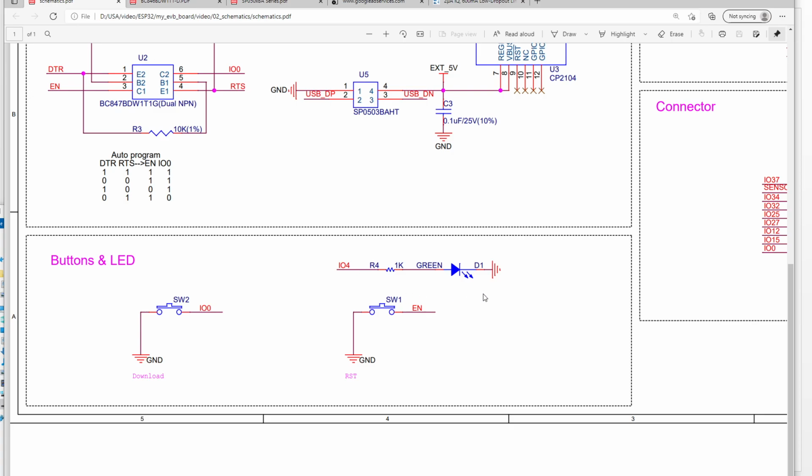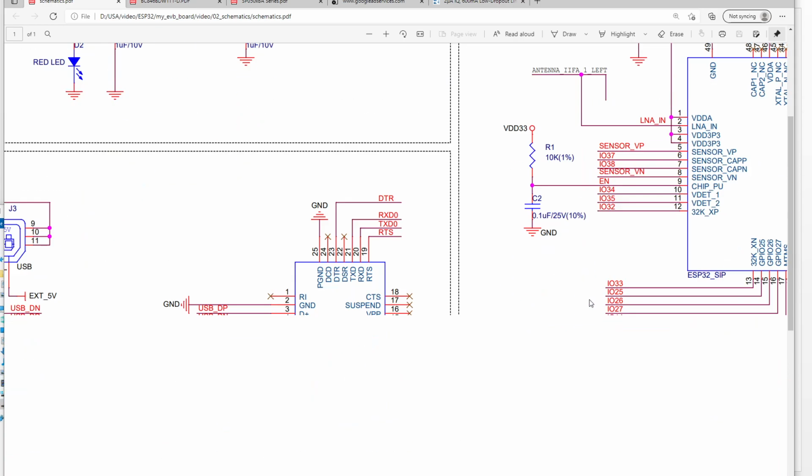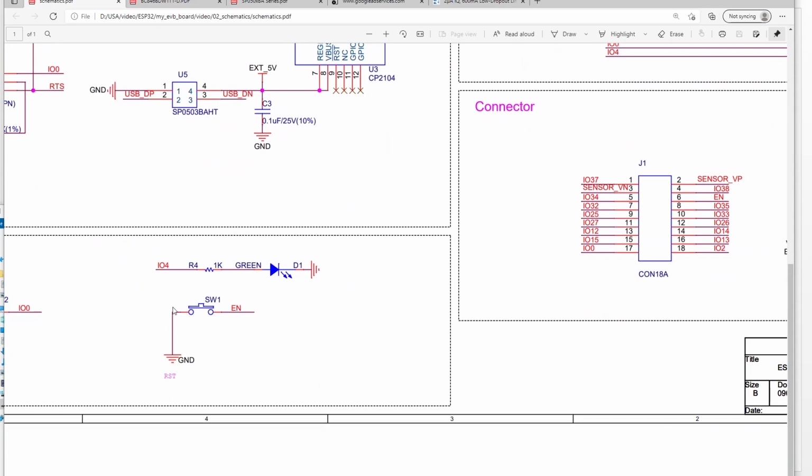And this one is very simple, it is an LED. We use one GPIO to control one LED. It's very simple, but it's very important. Why? When we download our software into the ESP32, how do we check whether it is running or not? So we can run one LED hardware application inside the chip. This is the first software we run on the ESP32 PICO to prove our download is correct, and also to verify our board is correct.